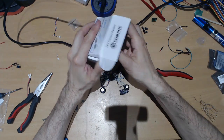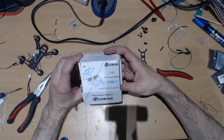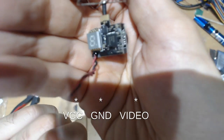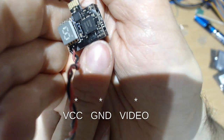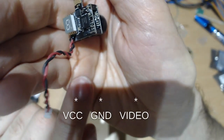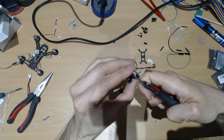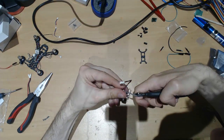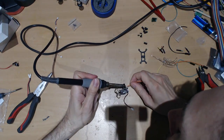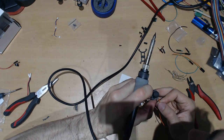So it's time for the camera. This is the TX-03, it's a 3-in-1. This type of camera has three pins on the bottom right corner — one is power, one is ground, and one is video in and out. So we're going to cut the corner here and break off the pin. Just be very careful not to break all of them. The video output is on the orange wire, and I'm going to solder it in there. That's not bad, it's pretty good.